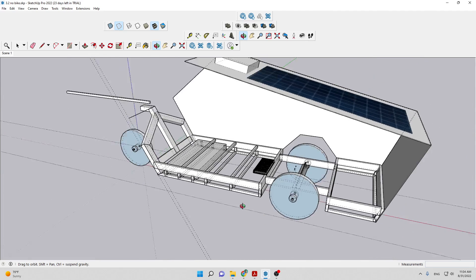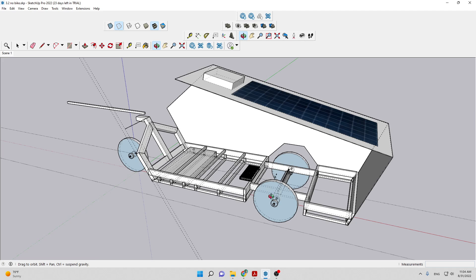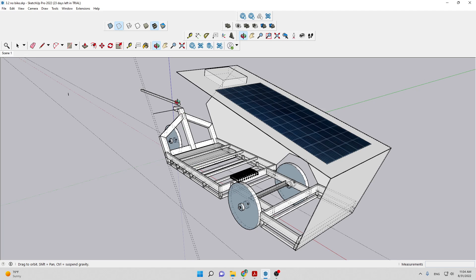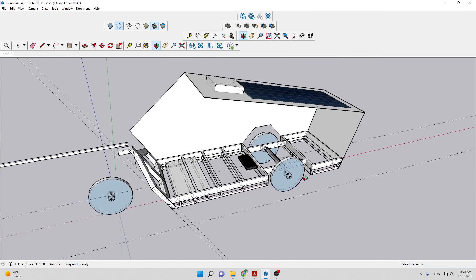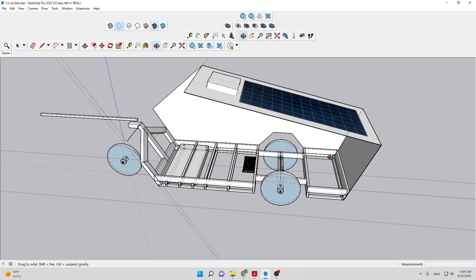The weight on this thing will be between 350 and 400 pounds; the axles are rated for 425 pounds. Next, planning will cover the frame skeleton, the walls, the ceiling, and wiring — then I think I'm ready to start building. I'll build this box first and this one, then connect them. I'll put lots of gussets in the various corners to make the frame extra strong and stiff.